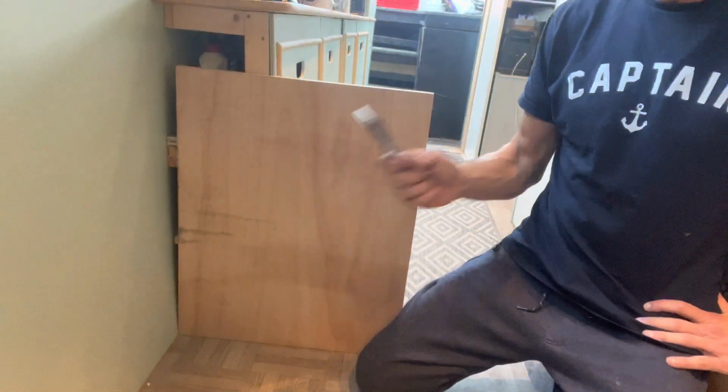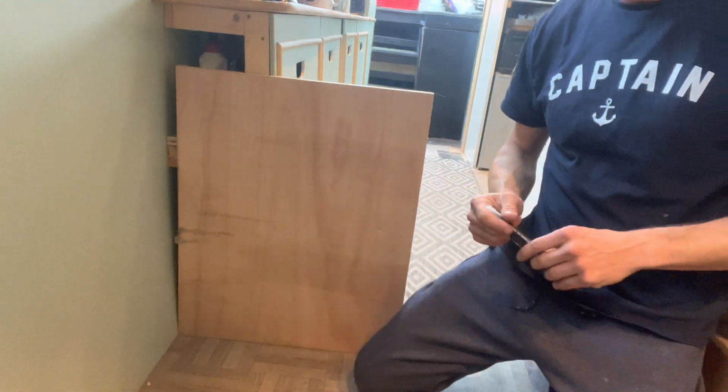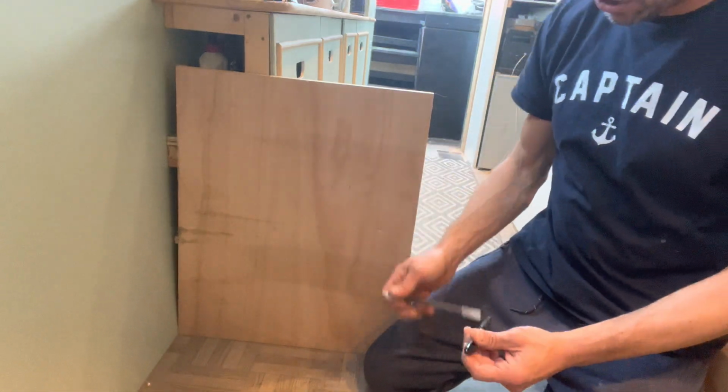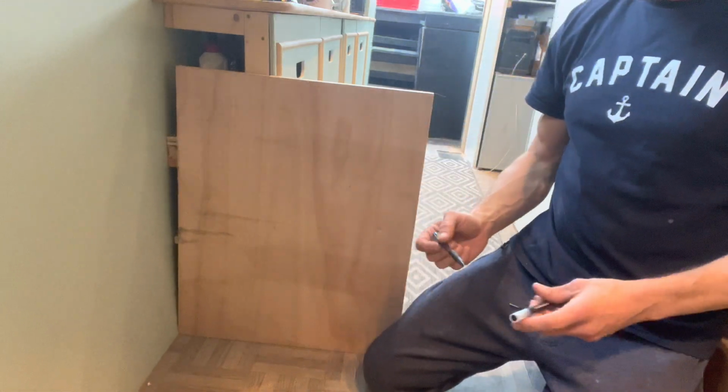I'm trying to do this only using offcuts because the price of timber's skyrocketed, and if I do it properly you won't be able to see the seam. So I'm going to do the seam basically where the shelf's going to come out, so make this into two bits. I'm going to scribe it to the edge there so it fits quite nicely.